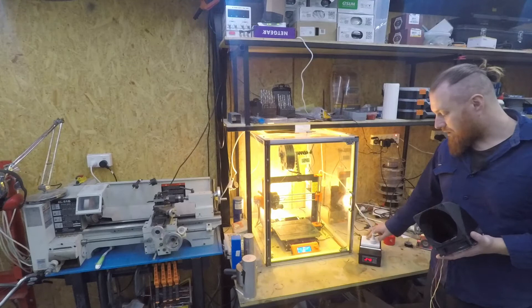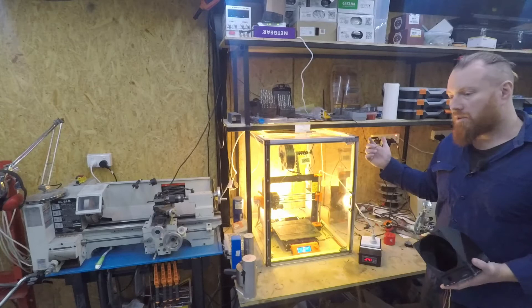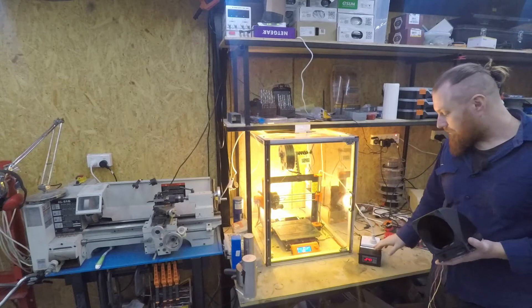As I mentioned before, you could add the cooling output — it could be used for an alarm, so that if it does get too hot and it wants to try and cool down, you know you've got a problem because it shouldn't really get that hot. Something's gone wrong, so you could add a 12 volt power supply onto a siren. In the workshop here, I might mount the siren outside so if I'm inside asleep I can come out and check it out, and if there's a fire, hopefully I can catch it before it gets too serious. That's one option with the STC-1000.